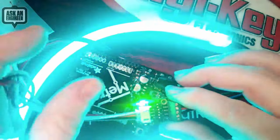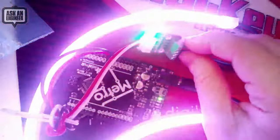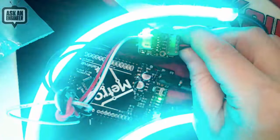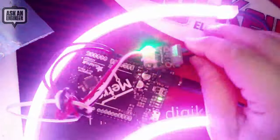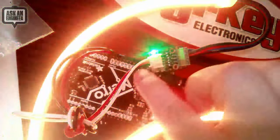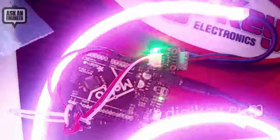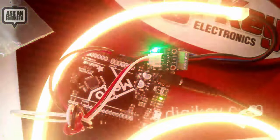This board can handle three amps per channel up to 16 volts, so it works great for gigantic star RGB LEDs or large LED strip arrays. It doesn't have to be RGB either — you can use cool, warm, or natural white strips, or analog strips that support color mixing from cool to warm to neutral white. If you're using more than two amps total, skip the JST-PH connector and go directly through the terminal block. You get nine amps total across all three channels.